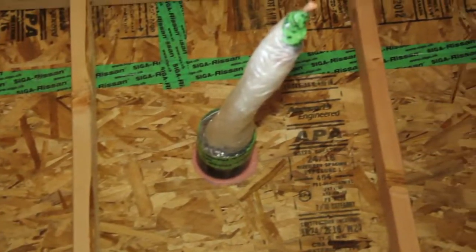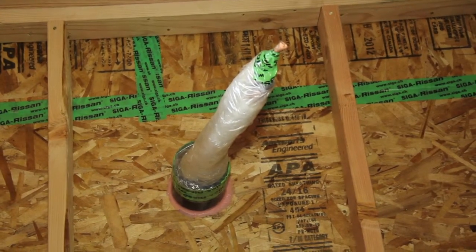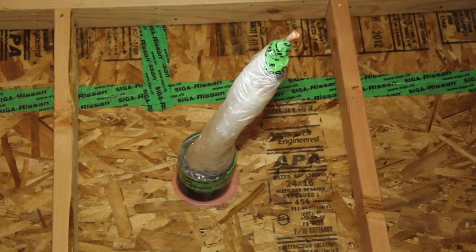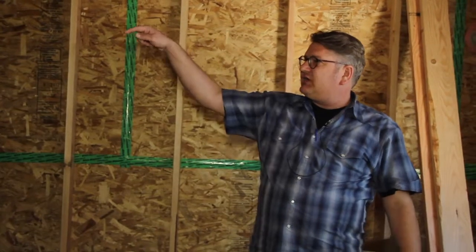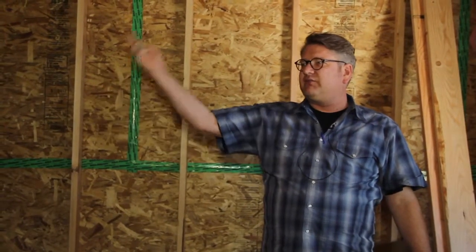When you go from 10 people to 80 people, this unit goes from 120 CFM all the way up to 300-plus CFM to ensure enough fresh air and oxygen. It's also used not just for ventilation but for distribution of heating and cooling, which is done by a ductless mini-split. The head will be up there where those pipes come in the wall — it's a high-efficiency Mitsubishi unit. As this unit brings in fresh air, the hot or cold energy from that mini-split enters the system through the heat exchanger and is distributed throughout the building.